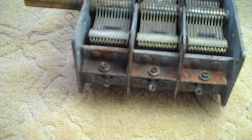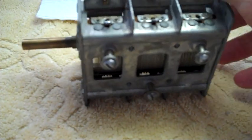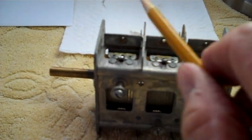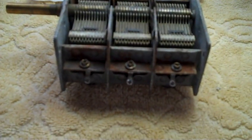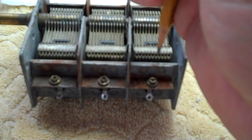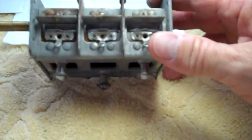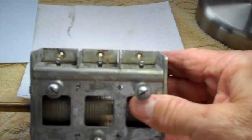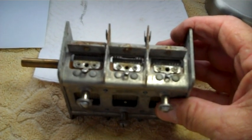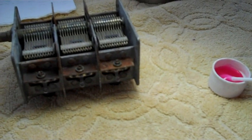A little slot there. And I took a pair of pliers and just kind of squeezed them together, and then ran the screws back up through there, and they're nice and tight. They'll snug right up now. So no more stripped. What happened was apparently I pushed too hard on the screw when I was unscrewing the nut, and it spread the collar apart. So that was a lucky break there. But if it hadn't been a lucky break, we know how to fix these things. It's called Plan B.